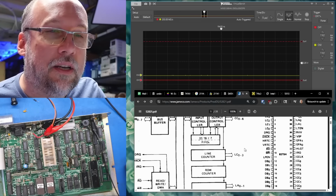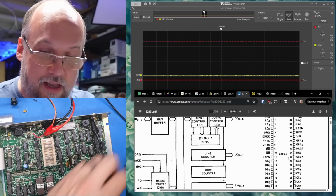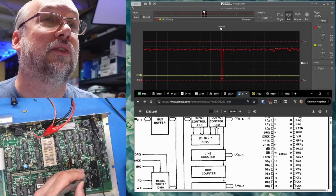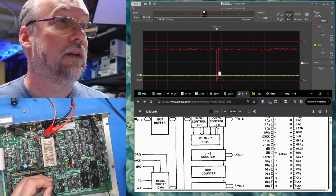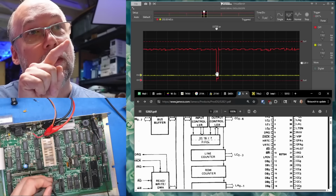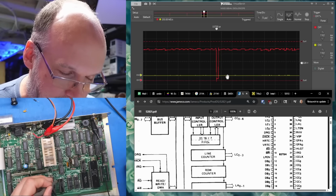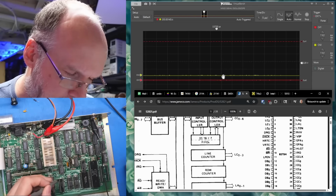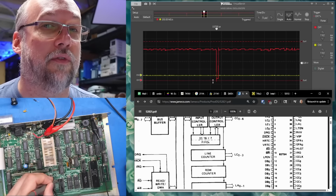Okay, now I'm noticing here is a read signal on the 8275 on pin 9. I bet you that's that same read signal that comes right off the microcontroller. Yes, there it is. Looks identical. You see those pulses up there. And you know what? Looking at the direction pin on the LS245, that is the RD signal as well. Without a doubt, that is the RD signal. So that's on the CRTC. And here it is. Yep, there it is on the LS245.